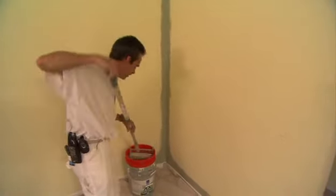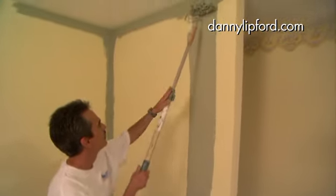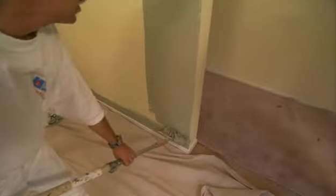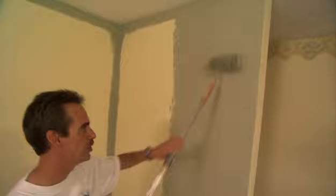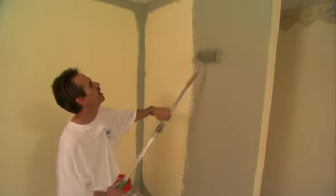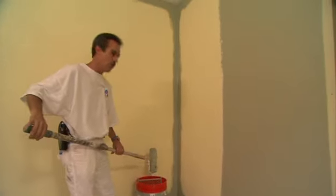Always keep your roller screen facing yourself. Get plenty of paint on it and try not to drip. Try to stay with an even stroke after you've got your wall cut in. Stick with a box-and-back-roll method — get your paint on the wall and then come back and back roll. This will get the excess paint spread out evenly on the wall. Nice, even strokes. Keep yourself squared up. Don't get ahead, don't cut too much. Cut a little bit, roll a little bit.